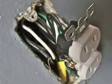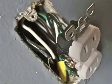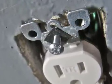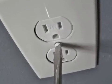I always leave enough extra wire to make a loop before I shove it all back into the box — you never want to cut the wire too short before wiring something up. Remember, leave yourself plenty of slack. I'm done wiring this receptacle, so I'll screw it back onto the box and then put the cover plate back on.